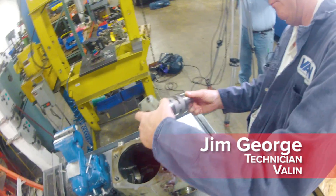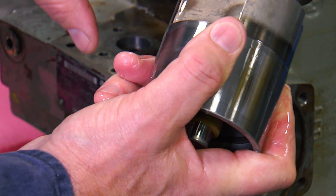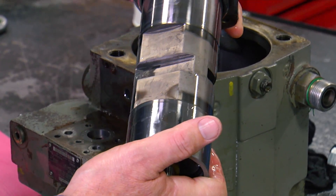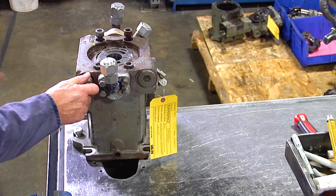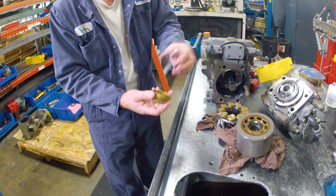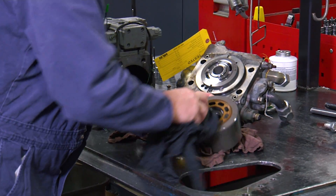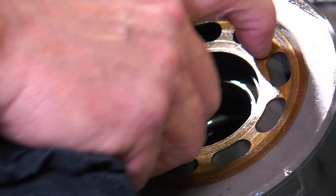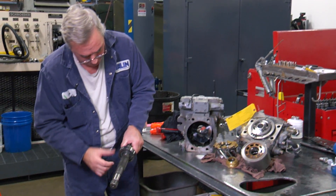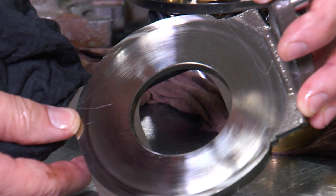These are the critical areas here and here, and this area is where the slider block slides — that controls the movement of the swashplate. As this moves, that swashplate moves, and that looks very good. This is what they call the cup spring stack, which is very critical and always gets replaced — similar to a bearing. There's only very slight cavitation; I'd reuse this without any problem. The swashplate looks beautiful, though the shaft will need to be replaced due to a little backlash.